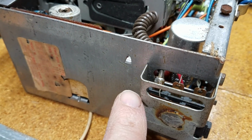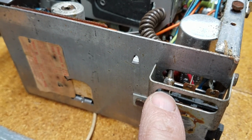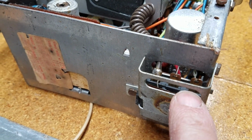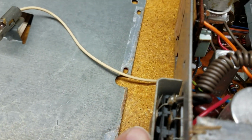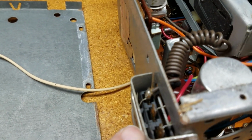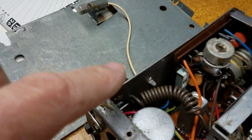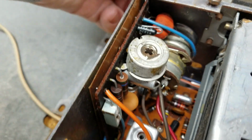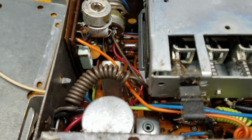And then there is a yellow wire, which is the radio feed, and that goes to this terminal, actually down here. And then there's a third terminal, which is a gray wire coming in as an input, and that is to power the lights, the instrument lights. And that would be this light here. So the yellow wire hooks into this brown lead, and that brown lead goes all the way to basically the on-off switch for the radio. So that kind of makes sense.